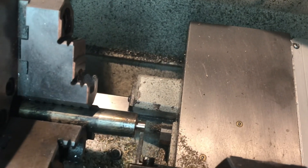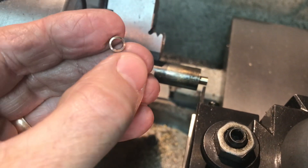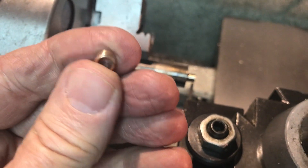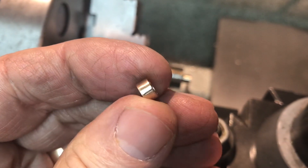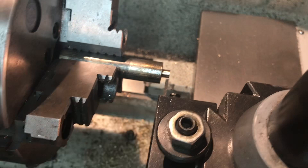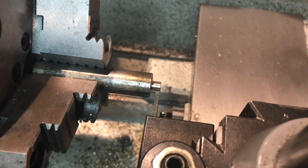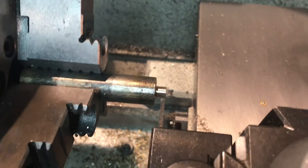For me, the first step with making the couplings is to make the bushings that go in. The front bushings are these tiny little things, so I have a piece of bronze left over from my Allen Mogul. I turned it down to an outside diameter of a quarter of an inch, drilled and reamed a 3/16ths inside, and now I'm cutting off the first one-eighth inch, and about ready to cut off the second one at an eighth inch.